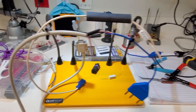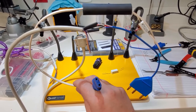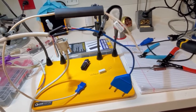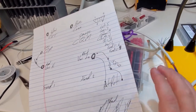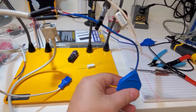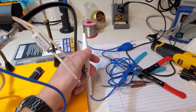Here you can see one of the female jigs I'm currently making for monopolar. The only special thing about the monopolar is this REM load, which has a 15-ohm resistor inline. That 15-ohm resistor basically activates the REM and simulates a patient. Based on the pinouts — which you can see I have written here — I verified my pinout. I did my pinout for this handpiece based on continuity testing.